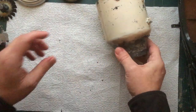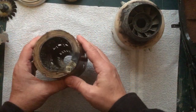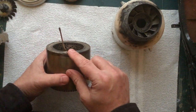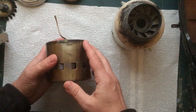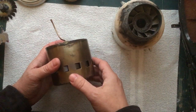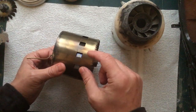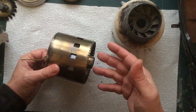And the combustion chamber in here. The combustion chamber, it's thin stainless steel. This tube right here is for propane. That just goes straight through and out. With this type of engine, you have to first get it preheated with propane before you can then start running it off of kerosene or jet fuel, which on this engine, I never made the line for the kerosene yet. I built it, put it together, ran it on propane.